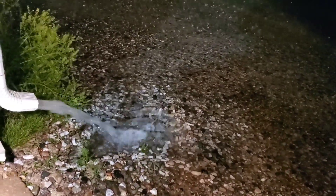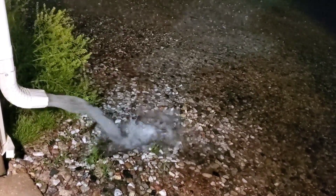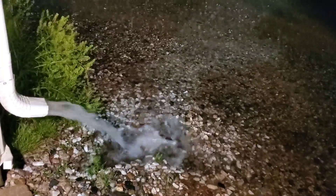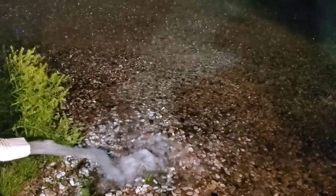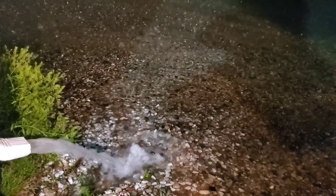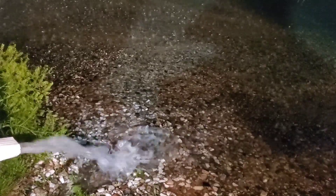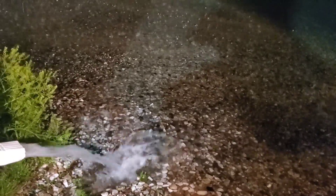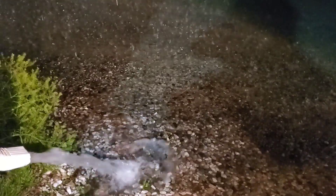There are some huge misconceptions. When you create restriction — when you have more water trying to find its way through the same size downspout — you just end up with more pounds per square inch. When more water has to go through the same opening, it'll flow faster. It actually picks up speed.